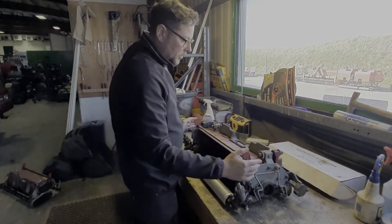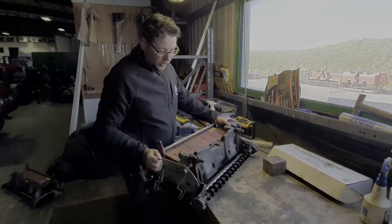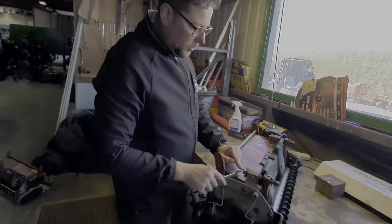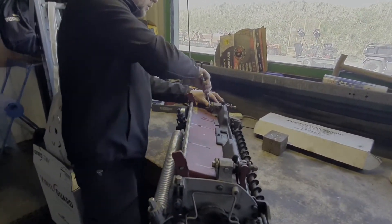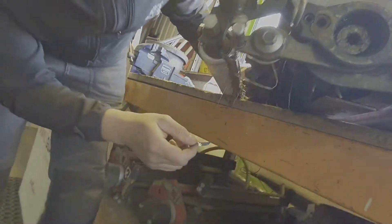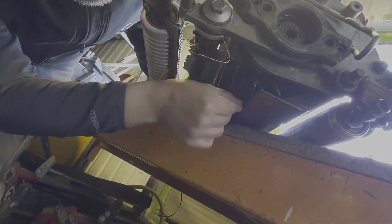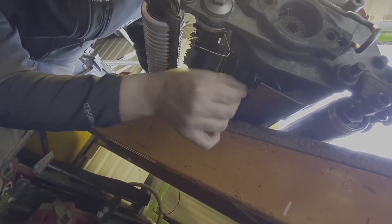That's why I'm always setting up in the lying down position. First, I come here and do two clicks back to slack. Bottom blade. Then I put the feeler gauge between the bottom blade and cylinder. At the moment it's going too loose, so I will tighten that for one click.